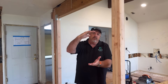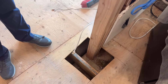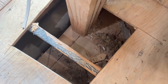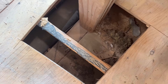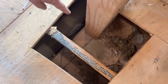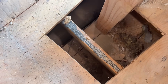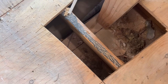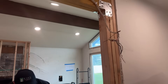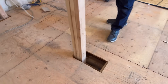A subfloor is hollow — if you look right here you can see the hollow space in the floor. You can see down here it's all hollow, but you see where that stud is sitting. They didn't get the bearing wall quite lined up as you can see with the wall that was up here, but it's close enough because most of it's still bearing on it. That takes the bearing from the beam down through these studs to this bearing wall — and this actually is a beam right here because they have an opening that goes through. That load gets transferred over to the posts, and each one of these posts we put in is sitting on the bearing wall, taking that bearing all the way down to the concrete footing underneath it.